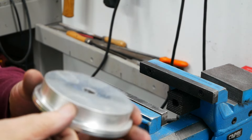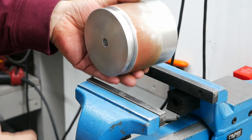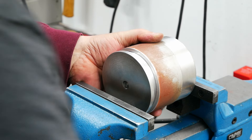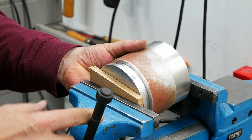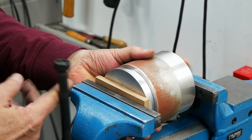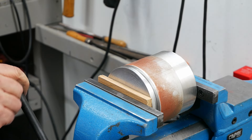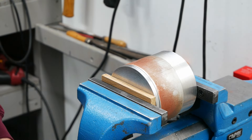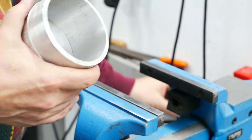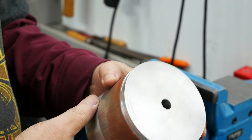I got it out of the ice box — had it in there for about 15 minutes, it's ice cold, can hardly touch it. Let's try to get this fit in here. I'm going to put a piece of hardwood in there so I don't mar the end of it, because the outside of the tubing is going to get machined. And here we are — looks good, it's a very good fit, and as you can see this is a little smaller than the tubing.